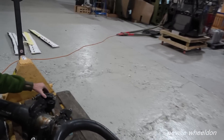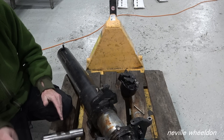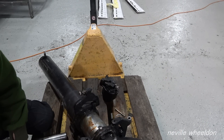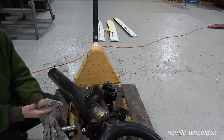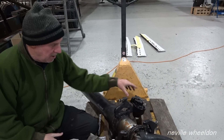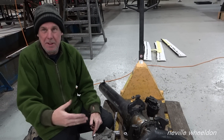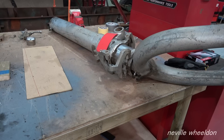This is a shimmy damper — a damper unit here to provide... this is what's called the shimmy damper. This damper corrects the rear wheel overcompensating the sideways movement when revolving. A lot of aircraft — like a shopping trolley sometimes gets the shimmy — well, these damper units here take the shimmy out, make it a bit stiff so it stops doing that when you're taking off.